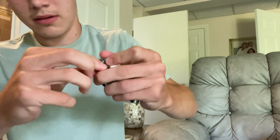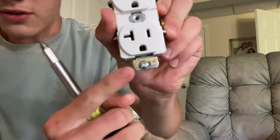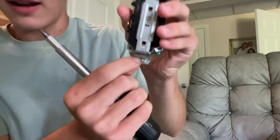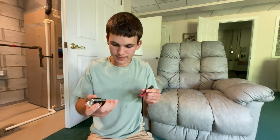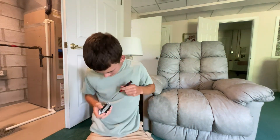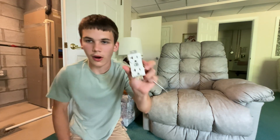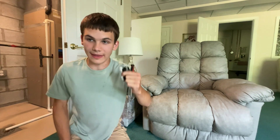We won't be needing to keep these black tabs. On the bottom screw, you're not going to be able to do the same thing because there's one of these grounding tabs here — this screw isn't going to come out. So you have to lift up on this grounding screw, which takes a little bit of work with your hands. You can take your micro screwdriver and stick it right on that metal tab. If you can't really see what I'm doing, you'll see what I mean when you try to wind that screw out. Now we have that out. We're going to go pull that plug apart and get it wired up, and then we'll be back to this cover.